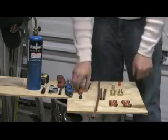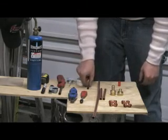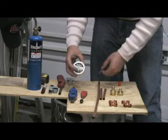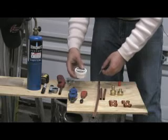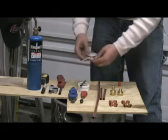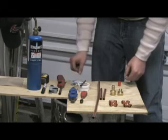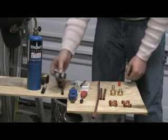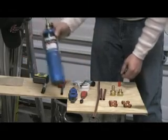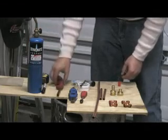Since we're going to be doing soldering, we're going to need a few tools. We have wire brushes to clean up the copper and the fittings. You need acid-paste flux — you can use the water-soluble stuff, but I prefer this. You're going to need a brush to apply it. We have some lead-free solder, of course — it's going into your wort, so you don't want any lead in there. You need a tubing cutter; this is a miniature one, but they come a little larger. You're also going to need your propane torch and a flame to light it.